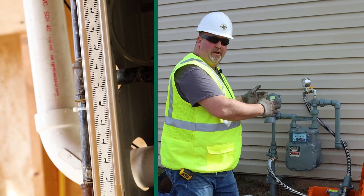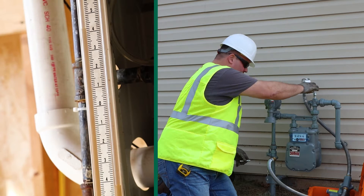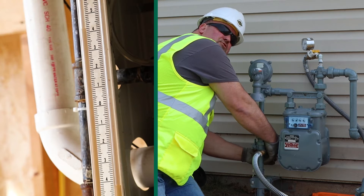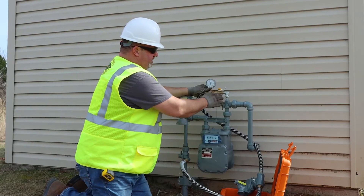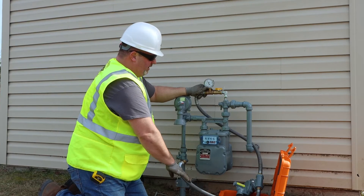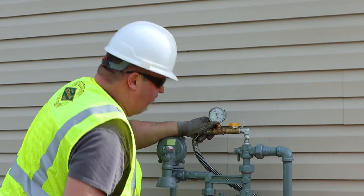And I'm going to quick connect my regulated hose kit. Currently we're in normal operation. With the valve off up here, we're going to take our key and back the plunger out until you get a hard stop. At this time, open up the valve up by the gauge. Allow your regulated hose kit to purge per company procedure. Tighten and secure the fitting.